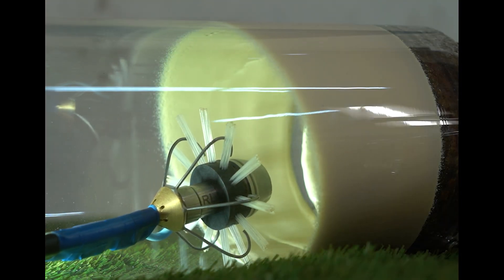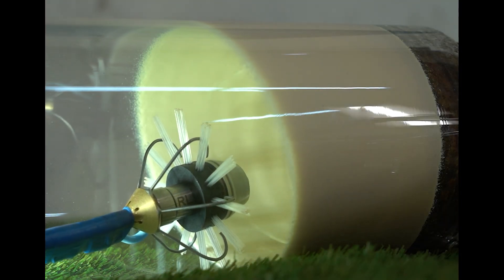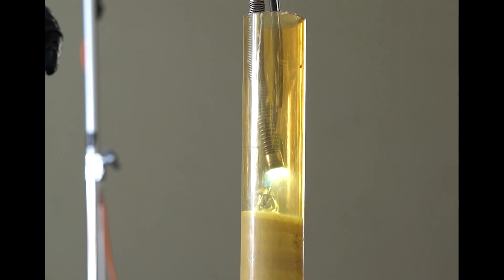There are a lot of guys out there using epoxy — I'm not going to mention any names — but once you flex it like this, it's going to crack. And guess what, roots are going to grow back in. You get what you pay for, guys. We use a polyurethane hybrid resin, and the re-pipelining system allows us to use their device and also the resin.